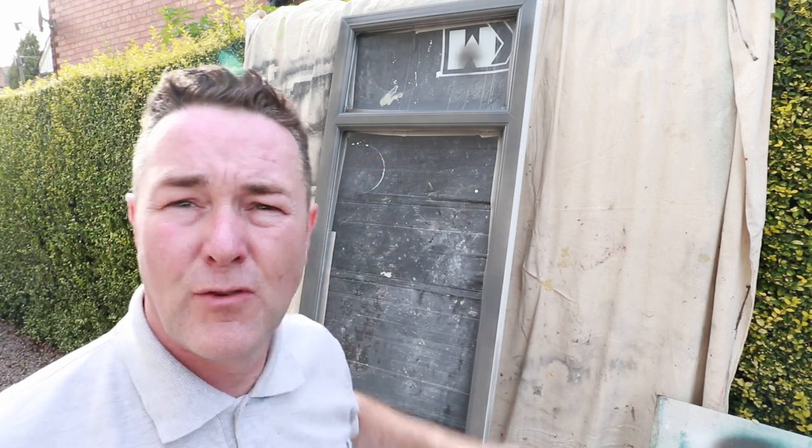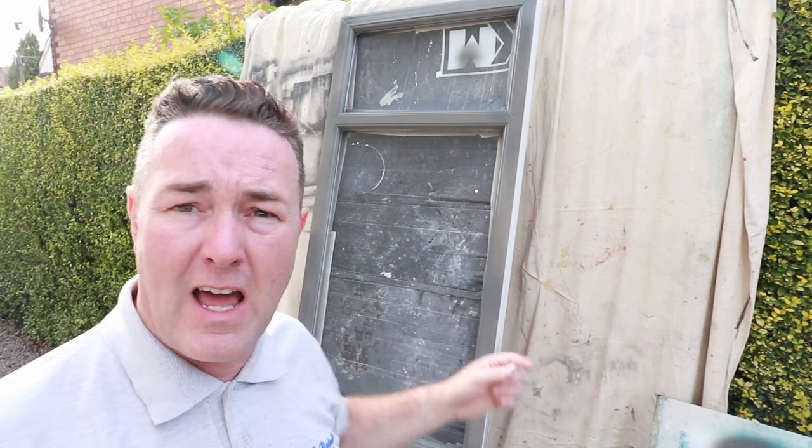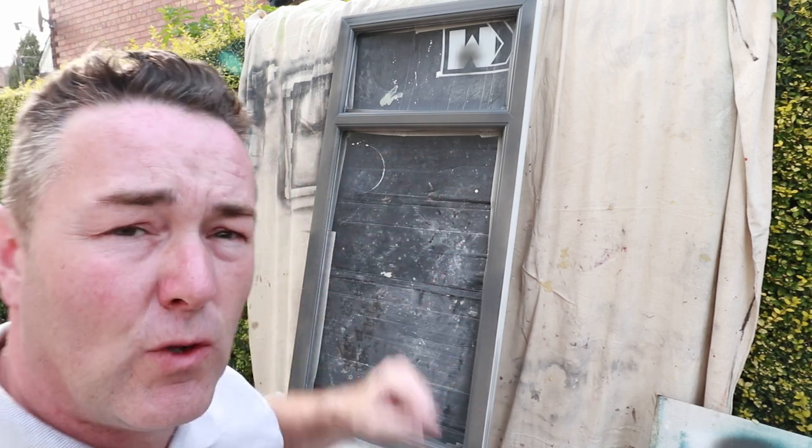Now, I'm going to give that another 10 minutes, then I'm going to give it another one, see what it's like. I'm not worried if I need to give it three coats over that mist, because how long it's taken me to do that, it's neither here nor there. Material-wise, neither here nor there. If I was pricing this up as a job, I'd allow for a mist coat and three coats, just in case. Now, some of you are going to say, oh, use such and such paint, you can get it out in one or two coats. I don't want to do that. I want to see what this is like, building it up in layers to get a better result than I did when I did that over my left shoulder.